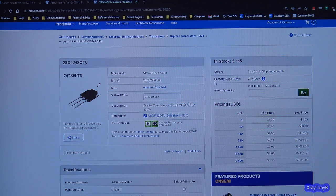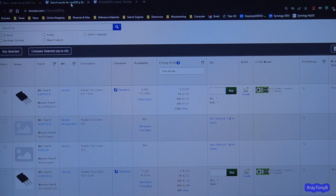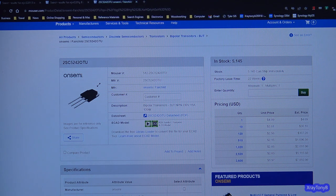For the module, if you're using it in a 50-watt amplifier, you'll probably be okay with the 130-watt part. But if you're using it in the RS-2010, you might be pushing it a little bit. You'd have to look at all the specs. Let's go back to the NJW-0302G, because this looks like an identical replacement for the original one we're trying to replace.